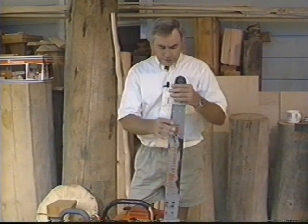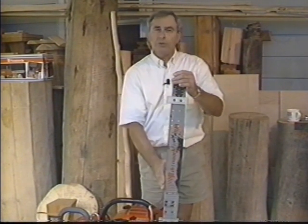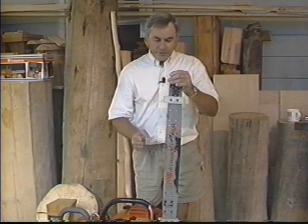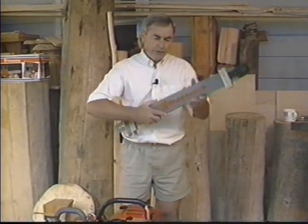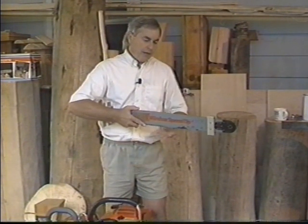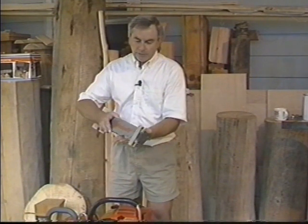There is some controversy when you're talking about bars about whether or not the bar should be straight or whether it should have some curve to it. There's two schools of philosophy. Obviously, if you're cutting into a workpiece straight on in, the bottom of that cut is going to be relatively flat. However, if it's rounded, once you've achieved a flat condition down here, you may be able to sweep sideways with the cut,